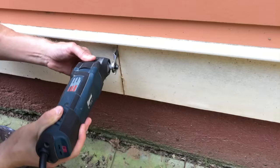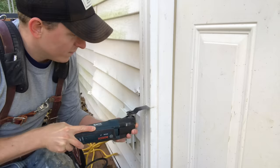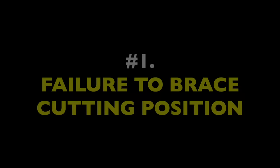It won't sit itself on the cut surface like a circular saw or jigsaw because it doesn't have a sole plate. You have to carry the weight while cutting, and the tool is free to swing and pivot in three dimensions, which complicates things. On top of that, it vibrates pretty heavily. This can cause grip issues, especially when using fine finger control, and it can lull your hand to sleep over long use. Cutting effectively with a multi-tool can be tricky, but there is a system — and it really comes down to avoiding a handful of things.